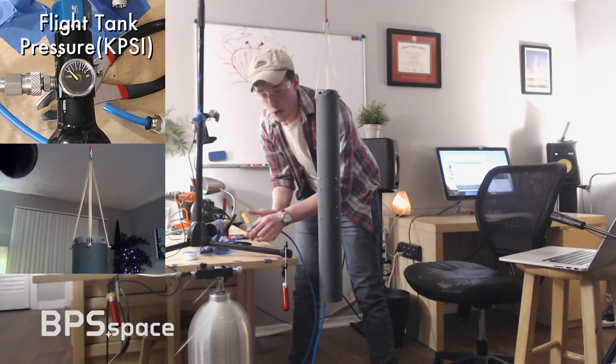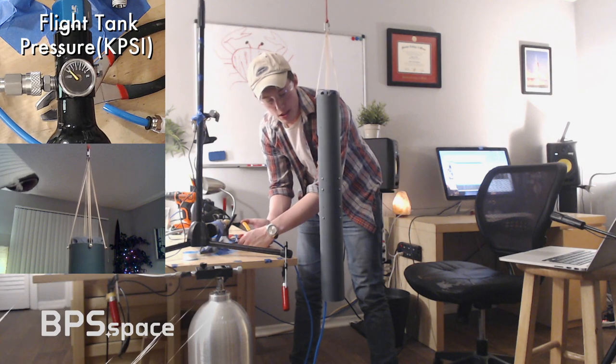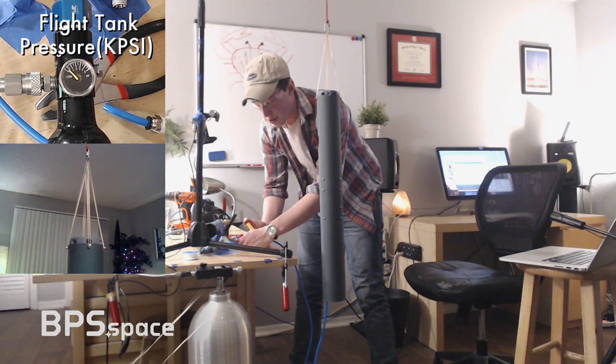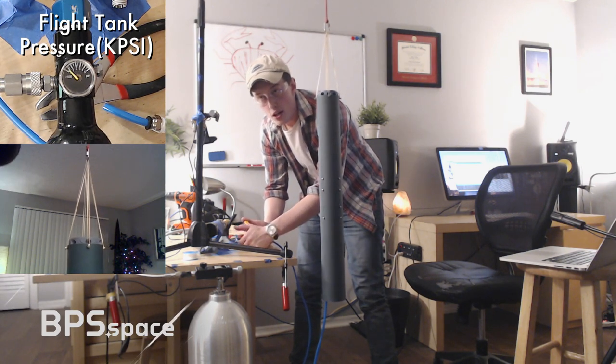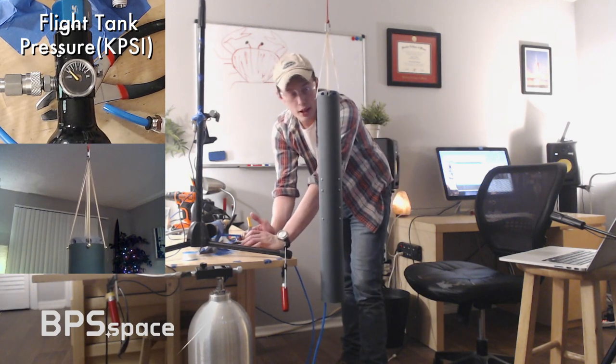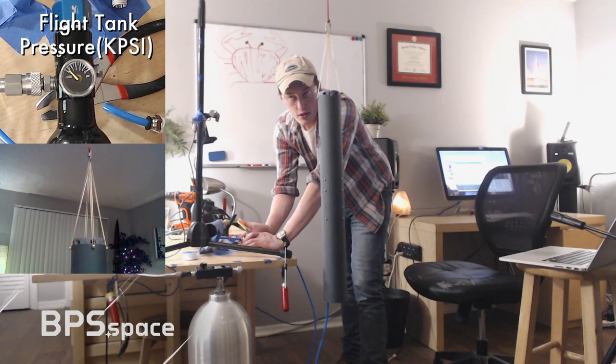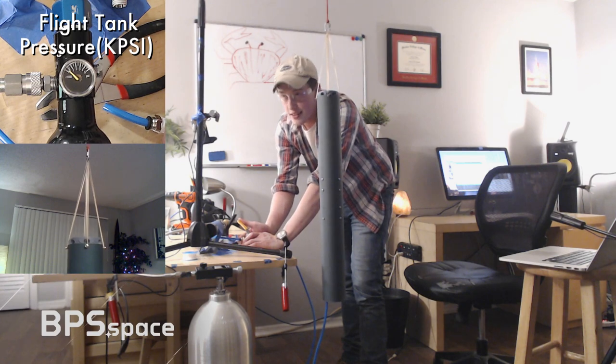So there's one valve in there that just does not have the force it needs because there's some block in air pressure where the valve is not properly actuating, or there's some problem. I'll do it one more time, and you can pretty clearly pick it out which valve it is in the cycle. Here it comes. That's it.